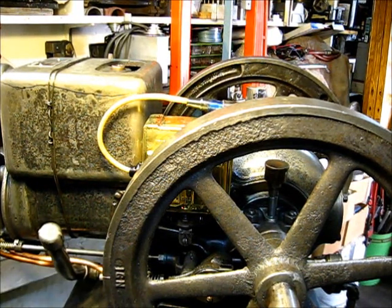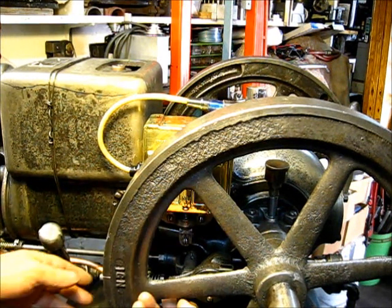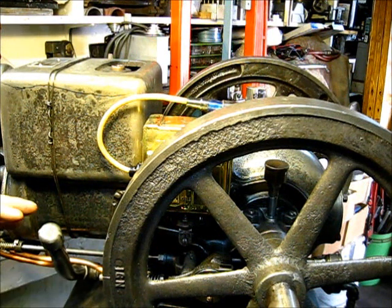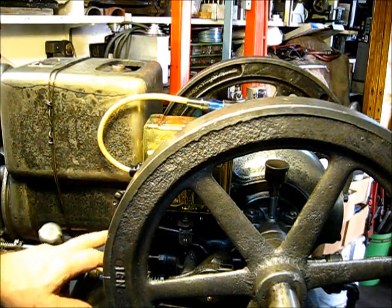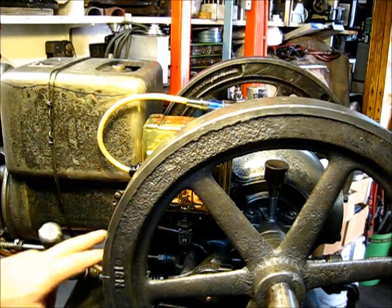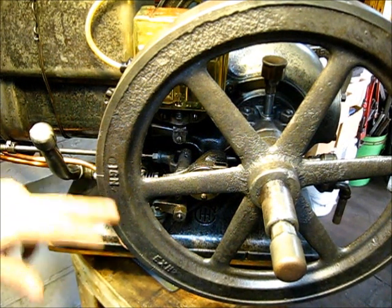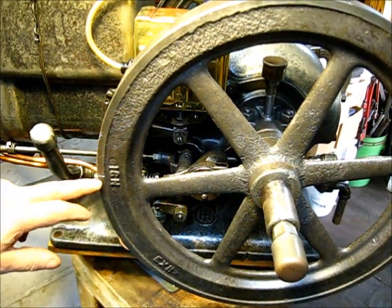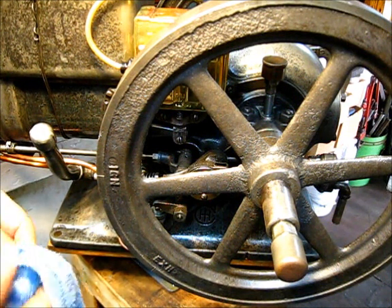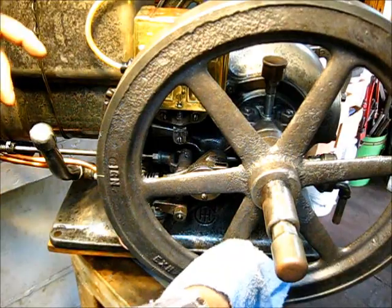Let's move that cotter out there. This whole mechanism is all loose — nothing is tight. But this is down in the run position. And the way that you time this engine: the flywheel has marks for exhaust and ignition, and they will be marked different ways from different engines and different time periods. Some of them will have it on the front, up here — even the International — on the face of the flywheel. And some of them don't have it cast in there, but the procedure is the same.